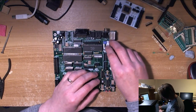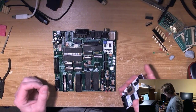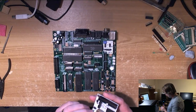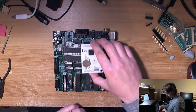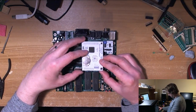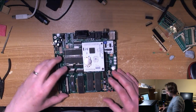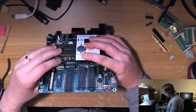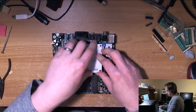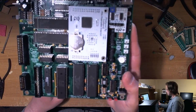I kind of want to go slow now, because, you know, the inevitable. Okay, so that's the UAV in. I'm assuming the jumper's all set up. Now when you put this in, be careful because it can go in one pin off either way, so match it up with the rectangle on the silk screen, or just make sure that the extra tall headers are going in centrally on the board. So this would appear to be completely assembled now.